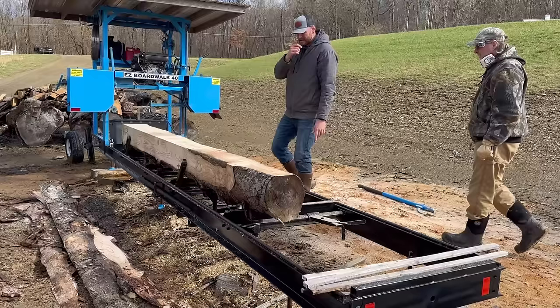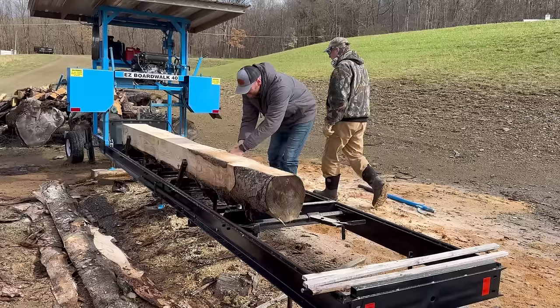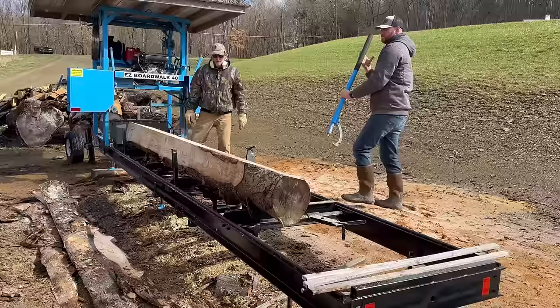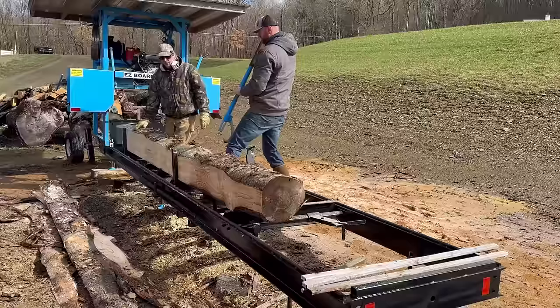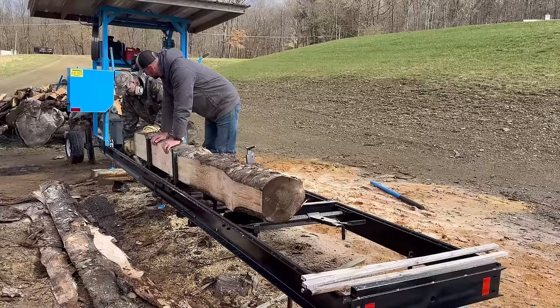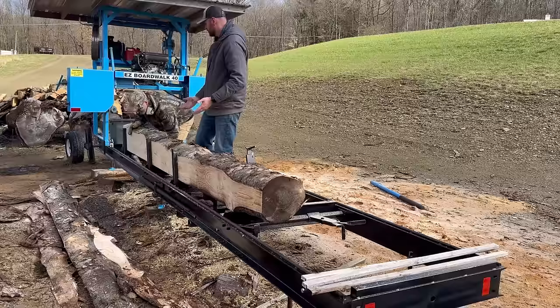You may be wondering why this end is not getting cut — it's because I'm probably going to cut this part of the log off anyway. To get a nice square cant out of this end would mean wasting a lot more lumber on the big end. I'd rather have more lumber that's 10 feet long than less lumber that's 12 feet long. Now that we've done two sides, we can undo the clamps and drop the hydraulic jack all the way down because we're done centering the pith.